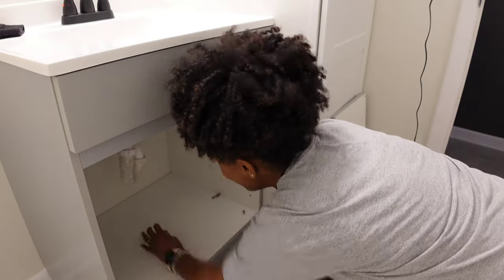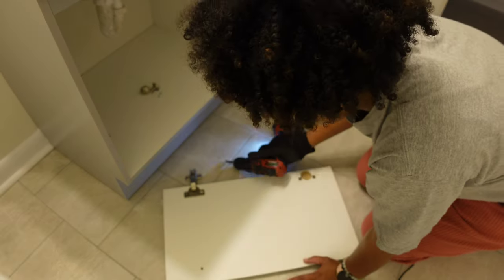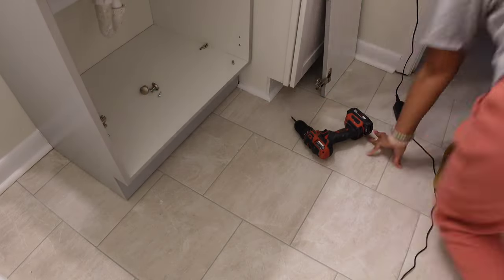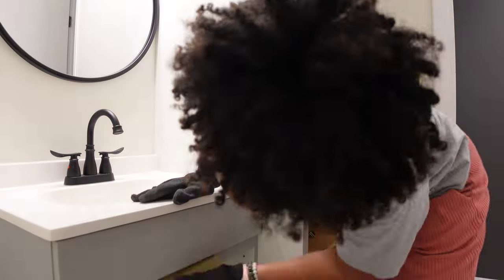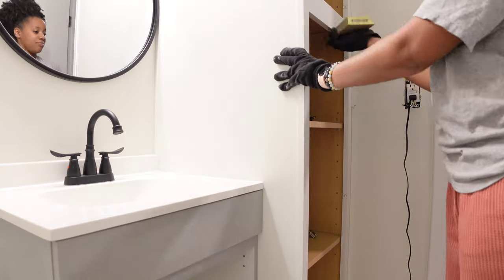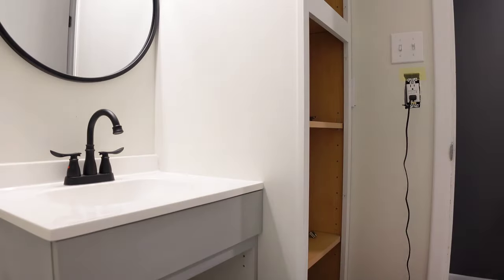Especially with these kinds of doors, they are already set in place — they've already been acclimated to that hinge — and it can throw off the alignment of the doors by a centimeter and it can definitely look wonky and crazy. You don't want those issues. So as you can see, I'm placing my hinges inside the cabinet and making sure I keep the left side on the left side and the right door on the right side. So now it's time to sand everything down. I'm going in with my sanding block, just to rough up the surface of those cabinets.